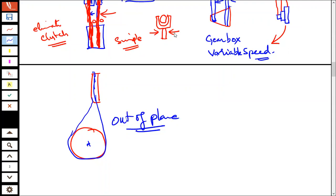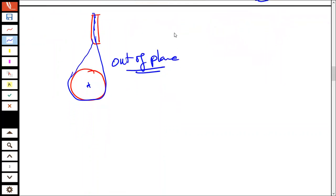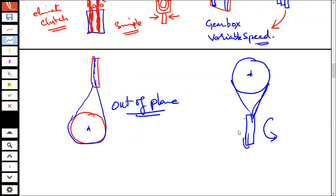Out of plane means you have one pulley in one direction and another pulley going into the screen in another direction. The belt is brought around on one side and the other side of the belt goes over the second pulley. This way one pulley rotates in one direction while the other rotates in a different direction. You would have seen this in many applications, including tractors. The book also has a clear picture showing this configuration.